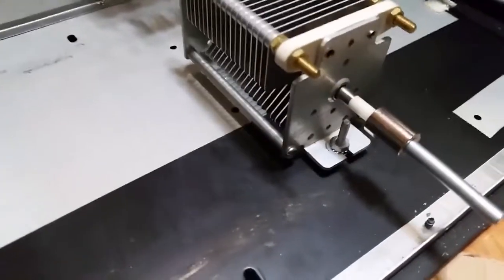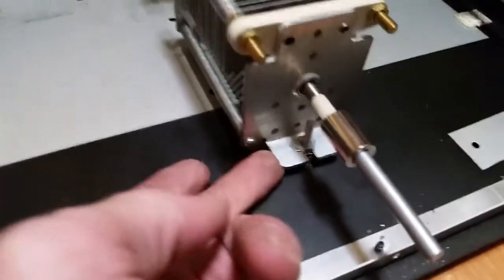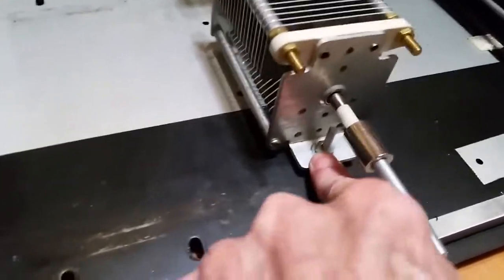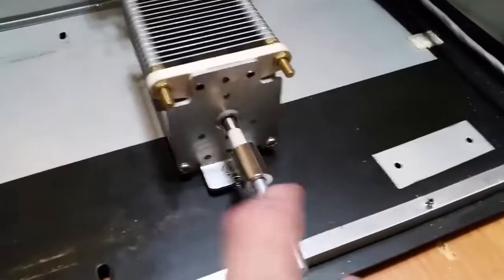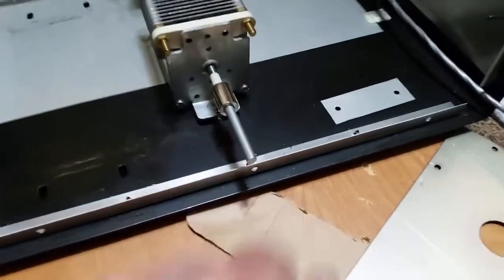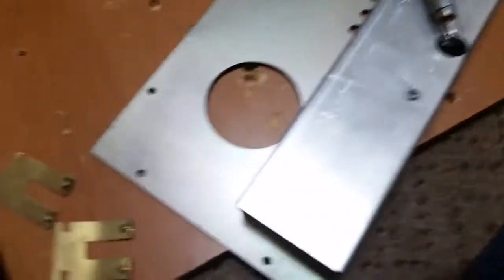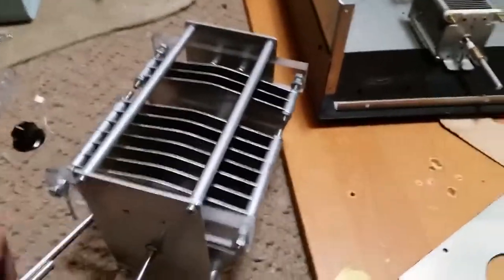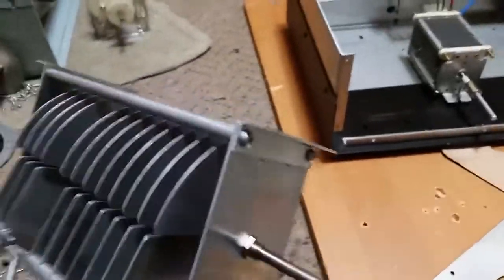I figured out where I needed to mount it — need a couple standoffs. I don't like standoffs on variable capacitors, but she's close. I custom cut my own shaft. Cut the first one and it was too short, so I had to cut another one. Got that shaft on there — she's happy. The air cap right here is a beast. This is one hell of an air cap.